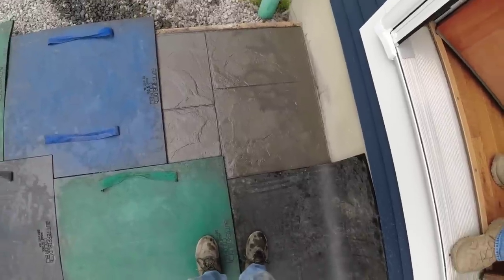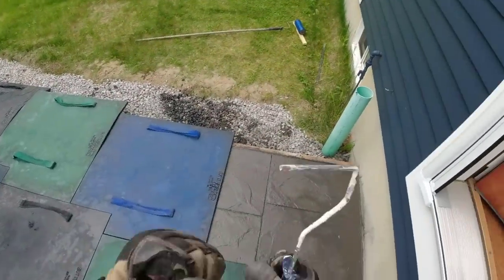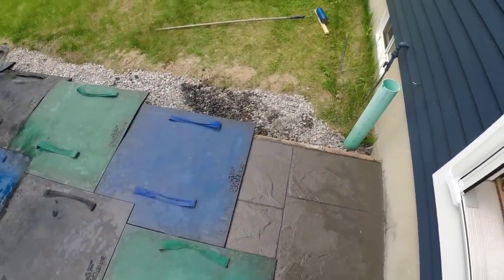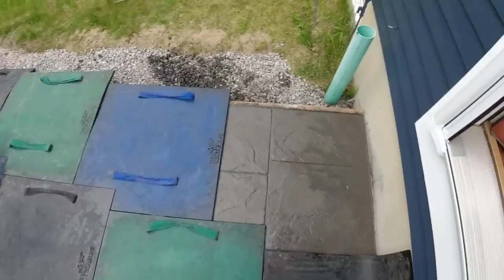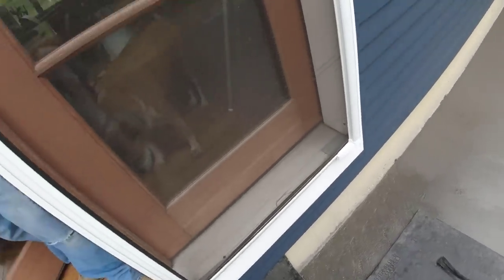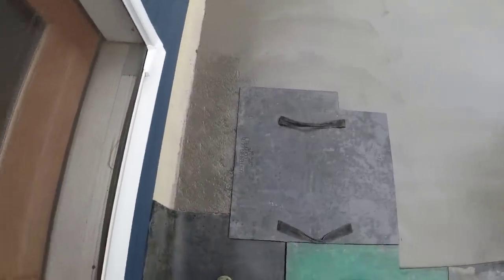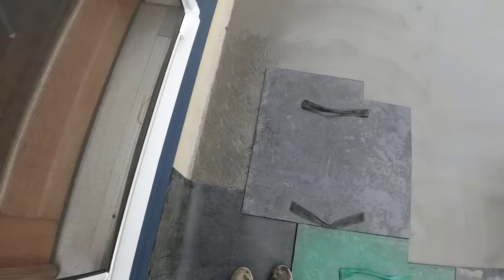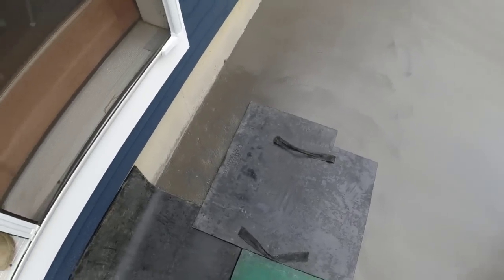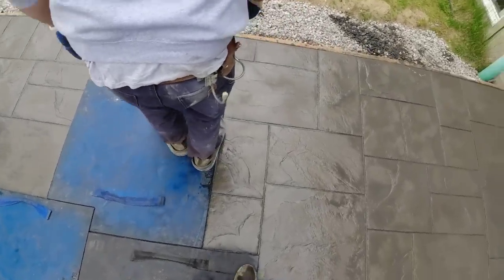Can't use a roller with those instead of just locking on? We don't typically use a roller. We do have some tampers in the back — if it starts to firm up we tamp it, we usually start out like this. If you have to start out tamping, you probably just got on it a little bit late. You must be able to tell by the feel — it's definitely a timing thing. Most people starting out would probably say, oh, that's way too soft.